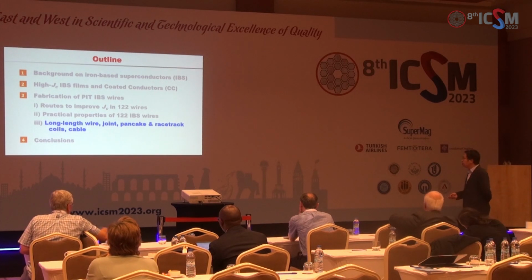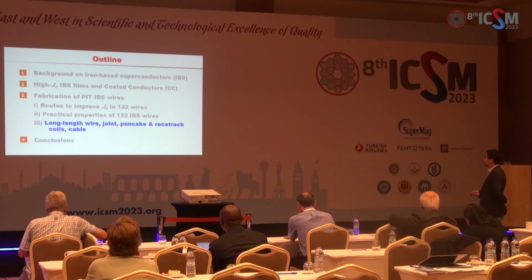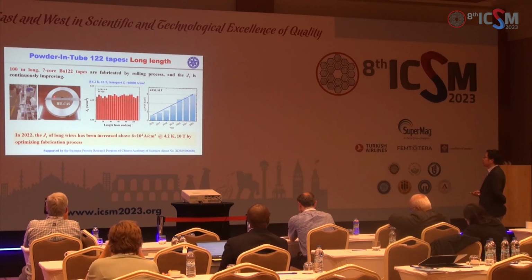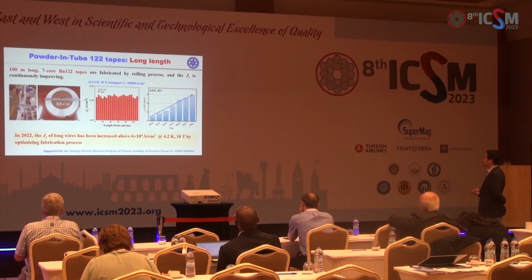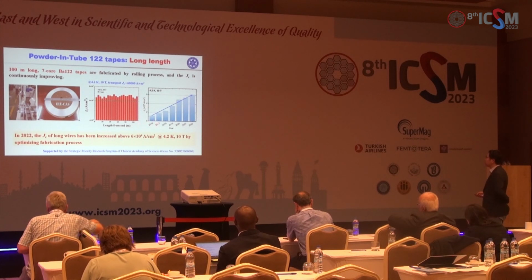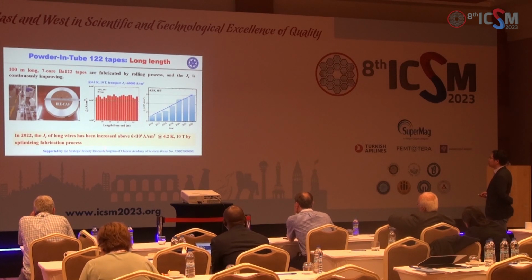Okay. In my third part, I will talk about the fabrication of long-length wire and their applications. Actually, our group is continuously fabricating 100-meter long 7-core tapes by the flat rolling process, and the Jc is continuously improved. From 2016, about 10,000 amperes per square centimeter, to recently Jc is enhanced to about 60,000 amperes per square centimeter at 4.2 Kelvin 10 Tesla, just by optimizing the fabrication process.